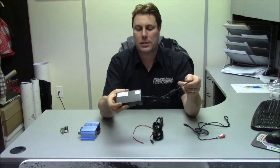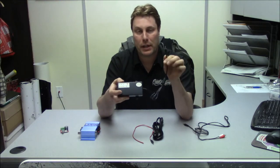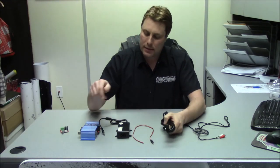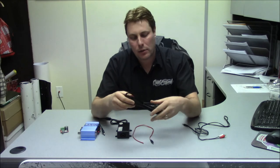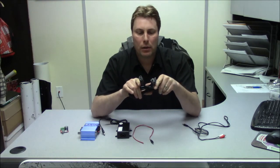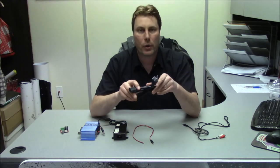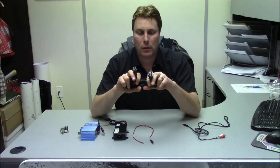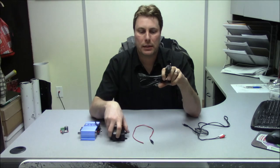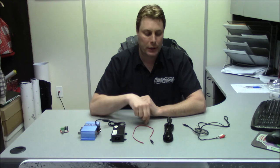For power, if you don't want to go either of those routes, we also offer a transformer — 12 volt, 2 to 2.5 amp — that is exactly the right barrel connector size. It's nice and clean, about four feet long. You can plug any standard power cable into it. It's actually a smart transformer that works in the UK, North America, China, and other regions, so it'll convert your local voltage — 110 or 220 — down to 12 volt.